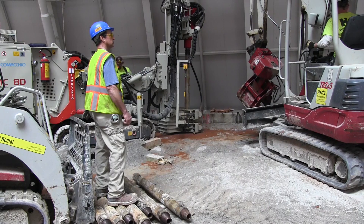Once these guys finish their drilling operations — they'll be out of here late next week, hopefully — we'll be switching over to starting work on the structural slab. That's about a four-week effort. We've got to excavate grade beams and tie in all the micropiles to the grade beams and the structural slab, so that'll be another long-going effort.